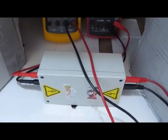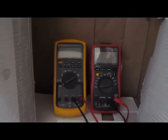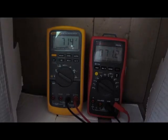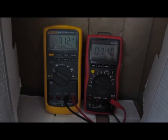And the AM510 is just connected through the attenuator, and both meters will be connected to the plate of the TR4 transceiver. Again, this was about 680 volts from our last testing, and it'll put out about 500 milliamps. I've been using this 87V for a couple of days now. The knob's a little tight, I guess based on what I saw with the little 101. I was expecting it to be a little smoother. So let's just give her a try here.